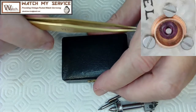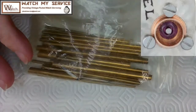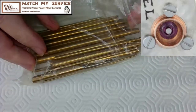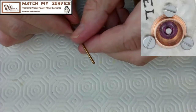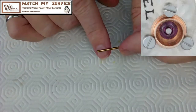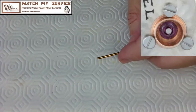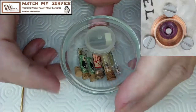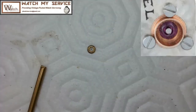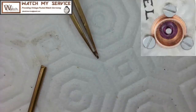I'll add a link to my video on how to make a jewel setting by hand. In that case I use brass rods — here's a whole selection of different brass rods. I'd face the rod off and using gravers cut the setting to the correct shape. Here's an old setting with a cracked jewel to show what a finished setting looks like — it's round and cut from a piece of brass or copper.